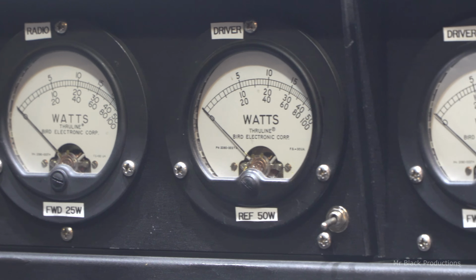Well, it pulls the battery down, because lead-acid batteries aren't very efficient at doing their job. They can only inrush a couple hundred amps. It'll pull it down into the 16-volt range. So you have 12 plus 6, an 18-volt battery, and it'll pull it down to about 16.5, which is safe for the Toshibas, but not so hot for the HGs or the HG2879Cs. It's not very smart.